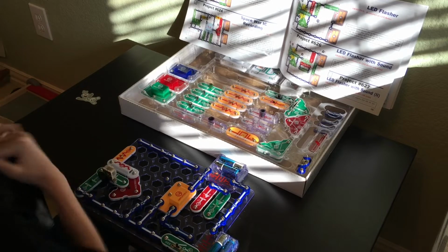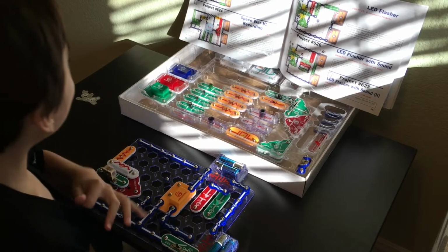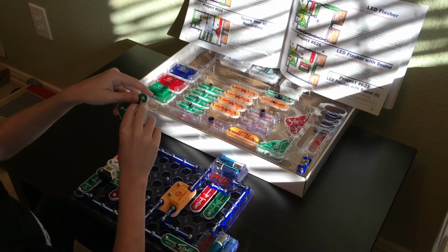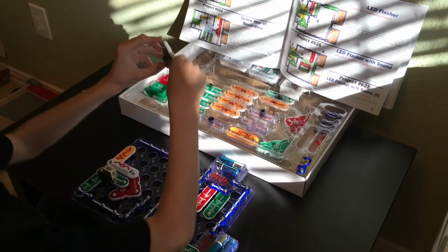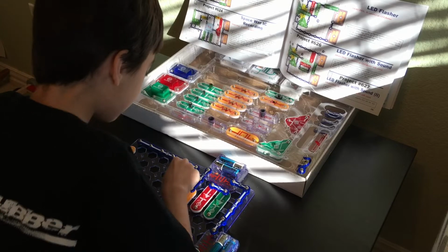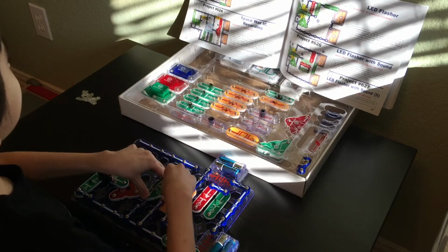Just like that, alright. And now, speaking of capacitor, not quite time for that yet, but what we're going to have is the RV volume resistor, which is what we're going to be using for this. Orientation is very critical again, it needs to be facing this way, not like that way, so it's just like this. And then we're going to have it over at C5, under C4, just like this. It's going to go between these 3 pins.